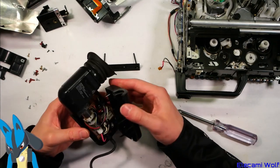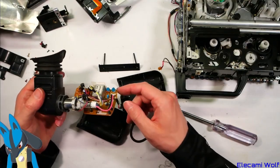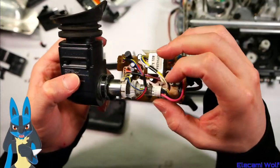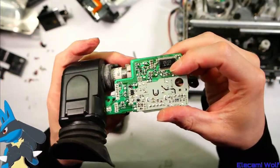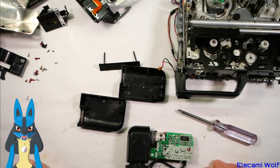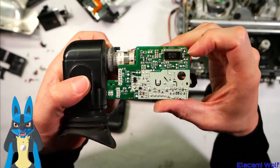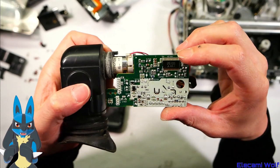Look at that — it's ground itself away to dust. So here's the viewfinder board. It's got the usual one of those things — the 2510s. The 2510s chip is the one that was used in the M3 viewfinder and presumably the M1 as well. That's the sync separator and deflection driving.